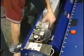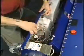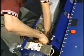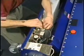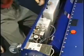Now, the oil tank, pump motor, and gauge assembly is all going to be mounted to this metal plate. So it all removes as one thing. The next thing we would do would be to unplug the wiring harness and the hose that goes from the oil control valve to the pencil tip.